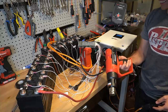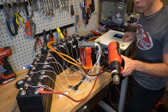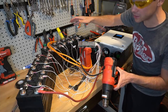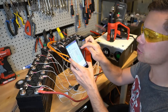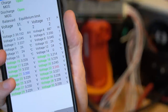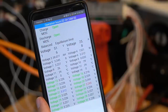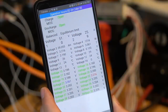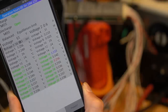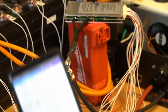It runs it at full power. We're pulling 1400 watts through 40 amp hour lithium iron phosphate cells — this is really powerful. Right now it shows how many watts are going through the BMS in real time. It's showing 890 watts... now I can turn it up and we're pushing 1300 watts. You can see every detail. Now let's turn the load off — it drops to practically zero, showing 31 watts which is the standby consumption of the inverter.